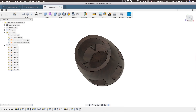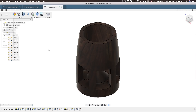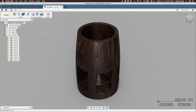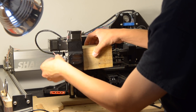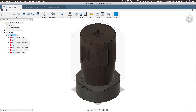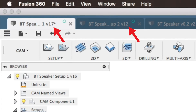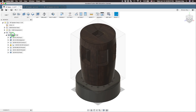Some key dimensions: my stock was going to be a 3x3 inch square turning blank, so the diameter of the speaker had to be less than 3 inches. I aimed for 2.9 inches to allow 50 thou of margin on either side, just in case my stock wasn't centered perfectly on the Pocket NC. The speaker, battery, and control board sandwich need at least 2 inches of space in the enclosure. The speaker also has to be no more than 4 and 1/8 inches tall, because anything longer won't be machinable on the Pocket NC — I found that out the hard way. Modeling this up wasn't all that difficult; it's just a revolve, some pattern cuts, and strategically sized and placed features. The tool pathing is where my confidence faltered. Keep in mind that what I'm showing are the final tool paths I ended up with — my version history is basically a series of edits and fixes that accumulated as I crashed or ran into limitations of the Pocket NC. I did not hit a home run on the first try.